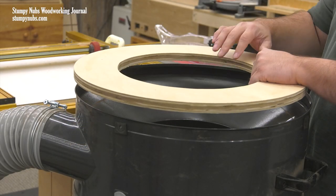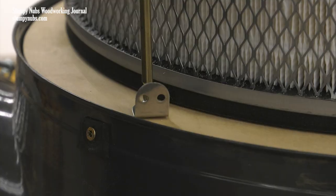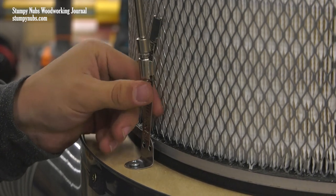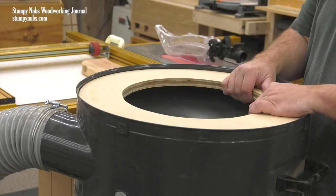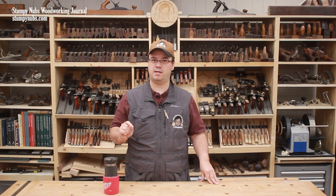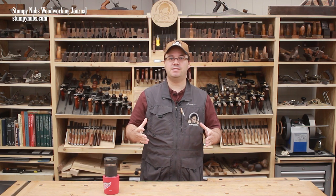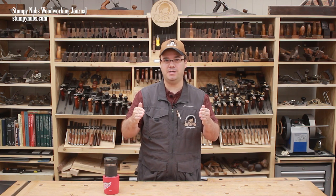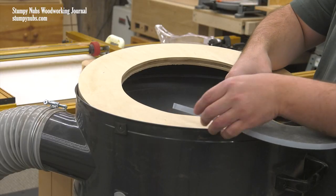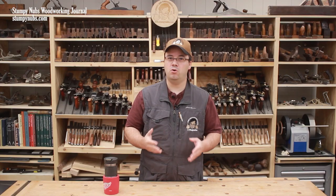But what if your rim is significantly larger than the filter, or you don't have a handy dust ramp inside to set your filter on? In that case, you'll need to make a donut out of plywood that fits inside the rim of your collector. Then you can drive screws through the steel drum into the edge of the donut and seal around the top with silicone. The brackets may be bent to 90 degrees and attached to the top of the wood donut with screws, and you may use your latches as before to secure the filter. Note how the rim of my dust collector's drum is slightly flared outward — the top of the rim is larger in diameter than the rest of the drum, so my donut was sized to fit just below the rim and slip down inside. Some dust collectors feature a bead around the top of the rim, meaning the top of the rim is smaller than the inside of the drum. You must size the donut to the smaller diameter so it will fit down past that beaded rim, but when you install it inside, it'll slip below the rim and fit loosely in the body of the drum. I recommend attaching some thin weatherstripping material to the edge of the donut to seal that gap, then add a bead of silicone on top to ensure there are no leaks once the drum is screwed in place.